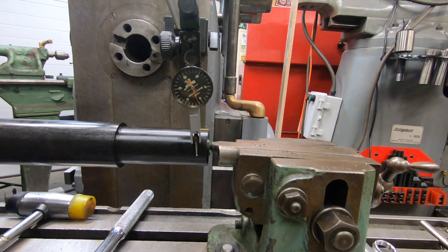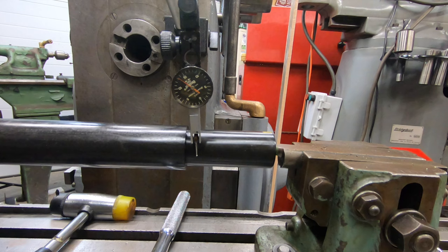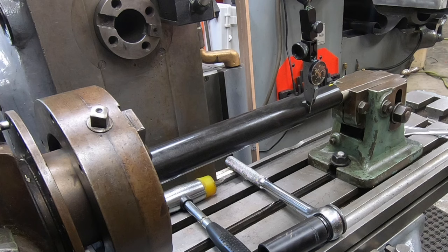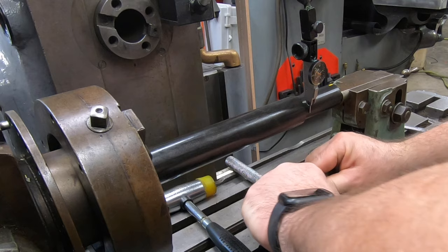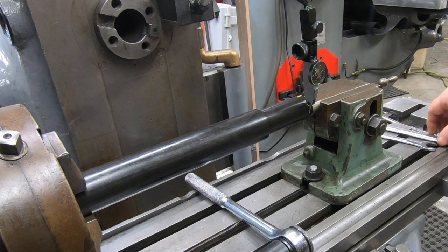Well, the next thing I want to do here is spend some time to see just how well the shaft is aligned with the Y and the X axis of the machine. I don't expect it to be all that accurate, but I'm hoping I can at least get it close. I really do need to either build a set of keys for the bottom side of the footstock and the dividing head, or maybe just take them off completely and manually align them each time.